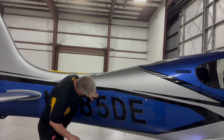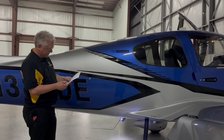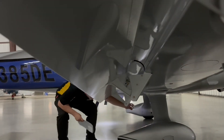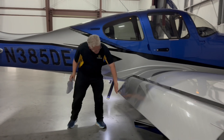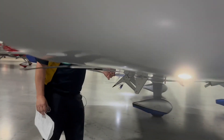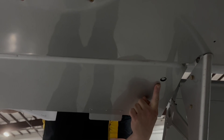All of these screws are in, holding that panel in. The antennas are attached, static port is clear. Going to check the flap assembly here and also get a little fuel sample. That's blue, no dirt, no water, no trash. Looking at the hinge attach points. On the aileron, free motion. On the underside of this, there is a hole in the aileron and there's a bolt, and that bolt needs to be safetied in place — that's the aileron-stays-on, does-not-fall-off bolt. Big fan of that.